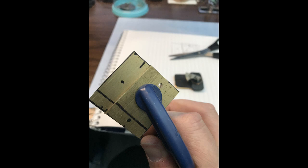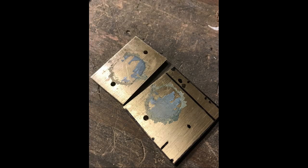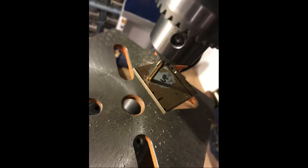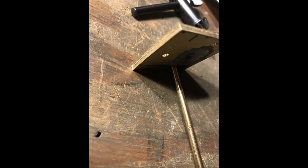The first thing I did was measure out two plates, mate them together with some Loctite and then clamp them so I could drill the two holes for the posts for the lift. There they are clamped together — I did all the measurement first and then unclamped them. There's Loctite in there, and after that I needed to tap out the holes. I used a one-eighth inch drill bit to tap the holes, then I needed to thread the brass posts using the same tap and die to make sure it was consistent, and then I did a coin as well.